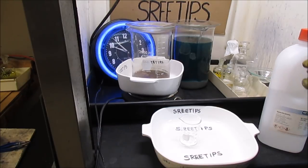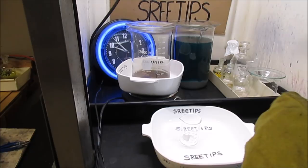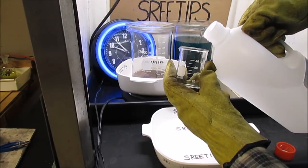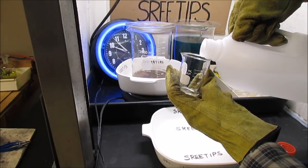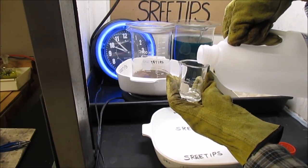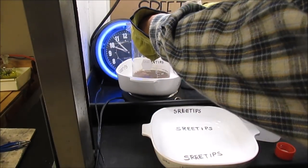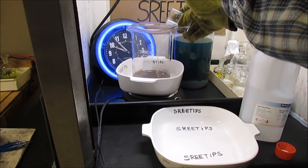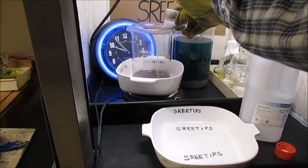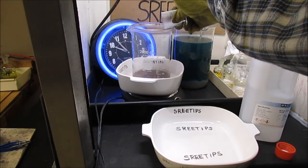The solution has been heated up now to almost boiling. It's been on the heat for about an hour and a half and I don't see any more fumes — or very light fumes. So I'm going to add about 20 more ml of concentrated nitric acid and see what kind of reaction we get, to see if we need to proceed with more acid extractions. I add the acid real slow and get little to no reaction.